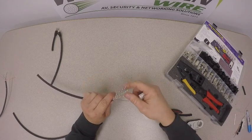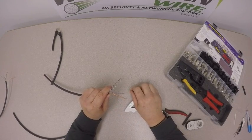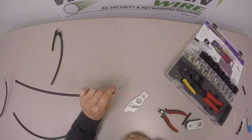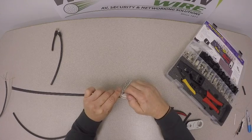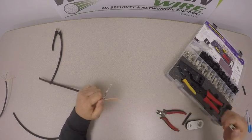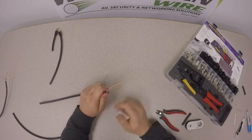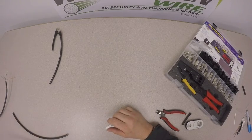This tool basically separates the pairs without damaging your fingers. The simplest way to do it is just to put a loop in the back of the pair. This tool has a needle that you feed into the hole you just created, and simply pull that, and it separates the conductors nice and straight for you. You want to do that on all four of the pairs.